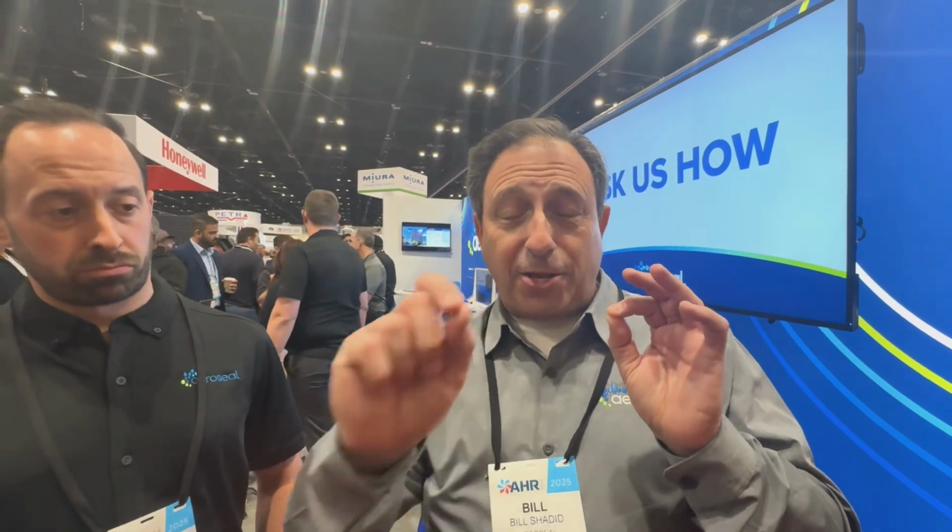And I can tell you just real quick, kind of in a simple explanation of how it works. The way we're sealing from the inside is we're using higher pressure inside the ducts. And I'll give you a quick example. If I had a balloon in my hand and I blow it up and I hand you a pin or a needle and you poke a few holes in that balloon, what happens? The air comes out, right? The air comes out because air always goes from higher pressure to lower pressure.